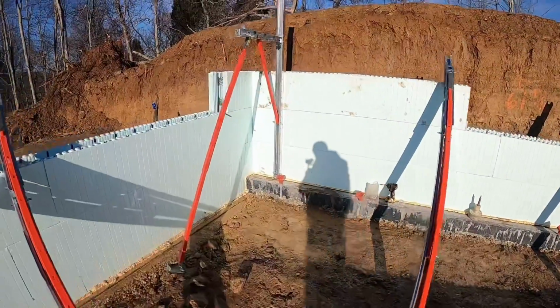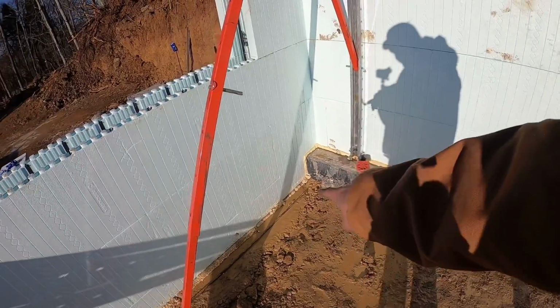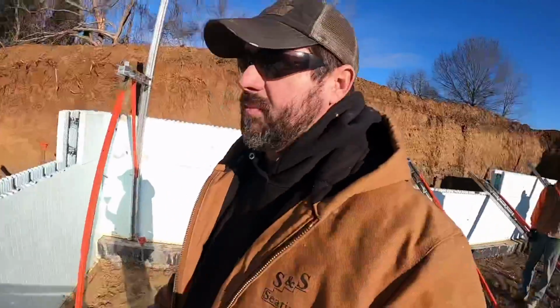The height also comes into play over here, in that the bottom of that brace is going to be a different elevation than that footer. On the braces I used before, we actually had to cut a 9-inch spacer block and set it up on top of a 2x4. With these, we'll just adjust the brace differently, which will be a lot nicer.